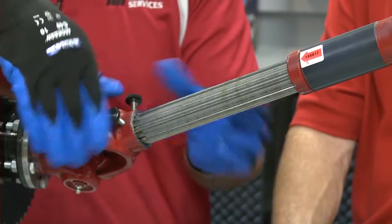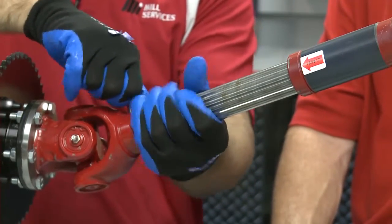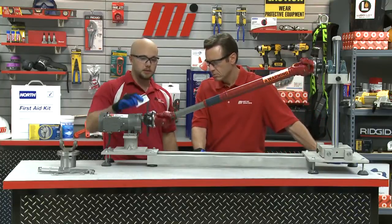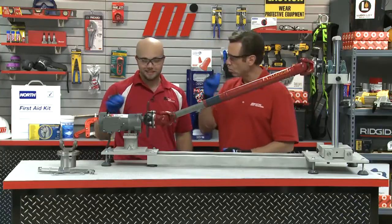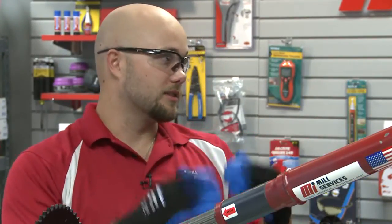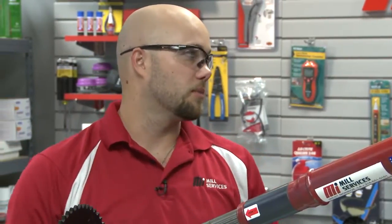Now we're actually going to mimic non-phased yokes to show what that does. I'm going to misalign these yokes 90 degrees just as an example. If a customer wasn't aware this was a problem, they would look at this drive shaft installed and not realize there's actually an issue. So what we're going to do is run this assembly and see how big of an issue this is. I'm going to try my side — it's going to be constant like usual on the drive side. Everything's still good. Now check your driven side. Oh wow — makes quite a difference! You can just imagine this being in application if the customer is trying to drive any type of driven equipment at a consistent speed. Vibrations would be shaking all over the place, and it even wears the drive shaft assembly out faster because the whole drive shaft experiences a pulsating torque on it.